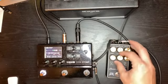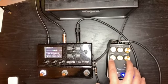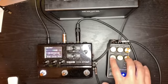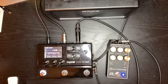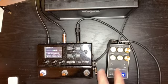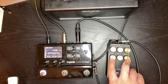I did want to cover the general controls. We already covered the switches and the variac control. Gain and volume are pretty obvious. But what I wanted to do with the high and low is these are not the standard Marshall tone stack. The standard Marshall tone stack comes after the last gain stage, and it really is more of a cut, whereas these are active. I meant these to be more like your studio controls.